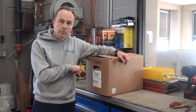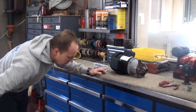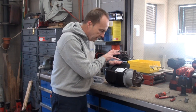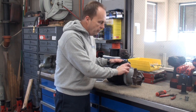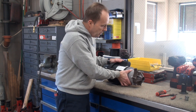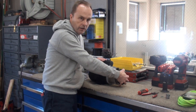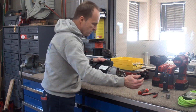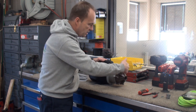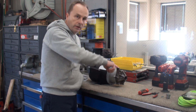Let's focus on the March pump and go ahead and unbox it first. Here is the March pump — you'll notice we've got the electric motor, then in between there's a spacer that looks aluminum but is actually plastic, and then this is your pump mechanism. This is where your inlet — pre-wash fluid for us — comes into the pump. It spins magnetically because the magnet is underneath this housing, and your output comes out of here.